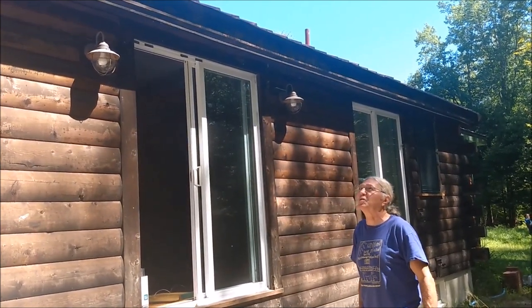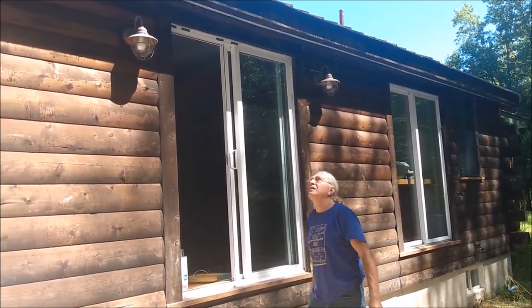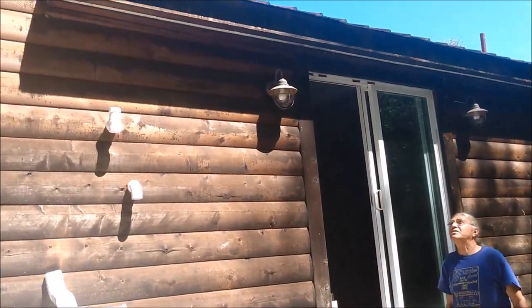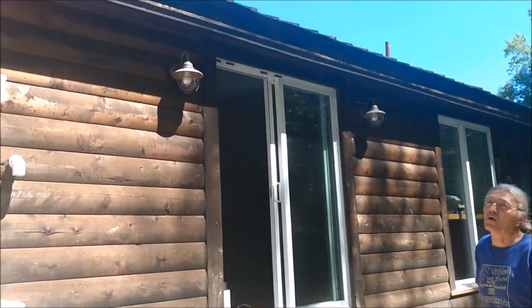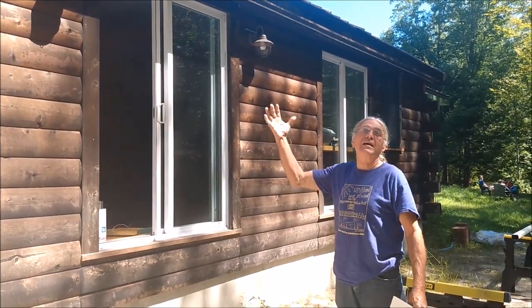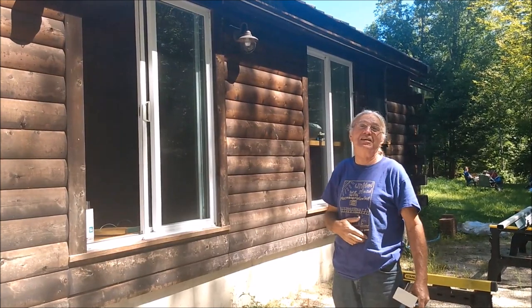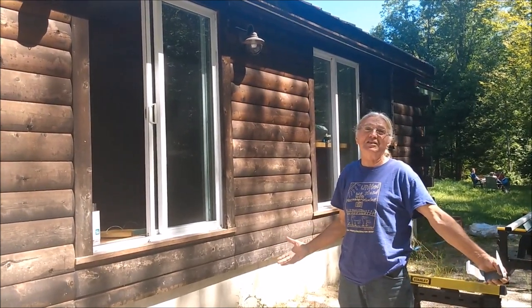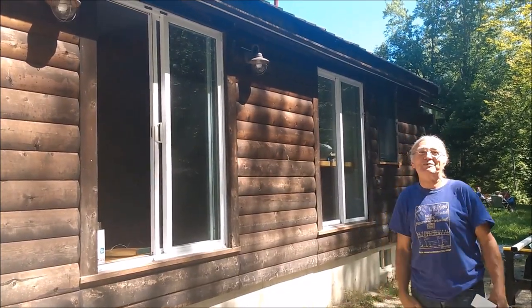Typically the overhangs are no more than 1.5 inches, but this installation was done and they extended it a little more than necessary, but that will be beneficial because when we have snow and ice buildup on the metal roof, with the extended overhang, the snow and ice will slide off the roof and pass the gutter instead of taking the gutter down with it, which obviously will be something that you will grumble about when you have to replace your gutter in the spring.